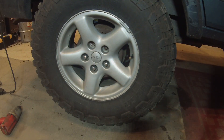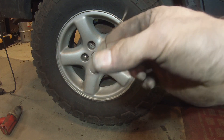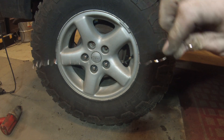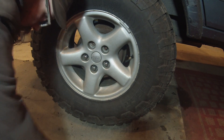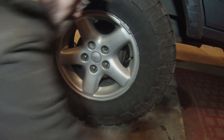I already drilled all the way to the bottom now. Look at that chip — that is a long chip for a hand drill. But yeah, if you tried drilling a half inch hole, you'd sit there forever, because you're trying to chisel off the width of that bit the whole time. And if you start small, you're just taking off little bits and it chews right through in no time.